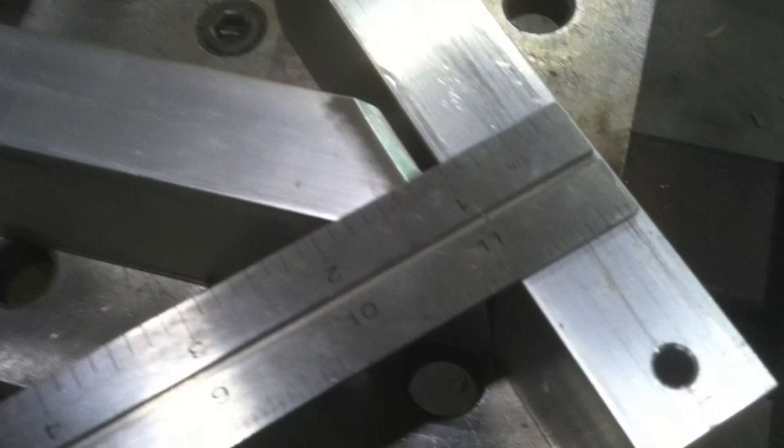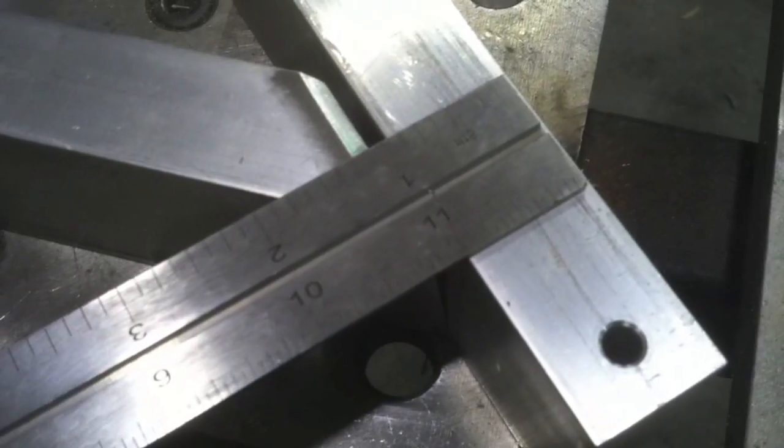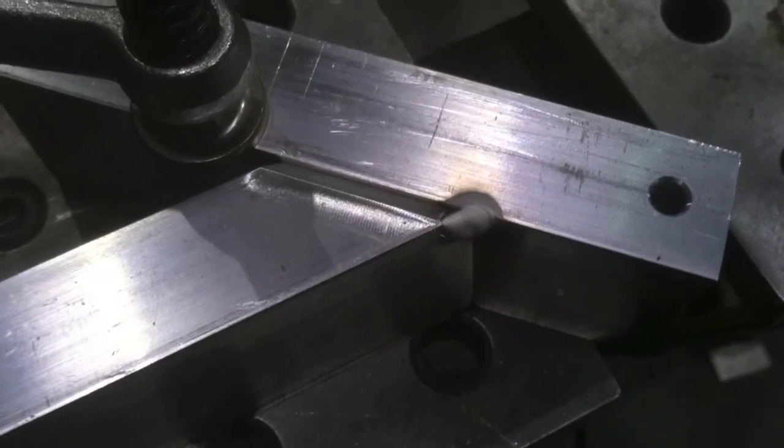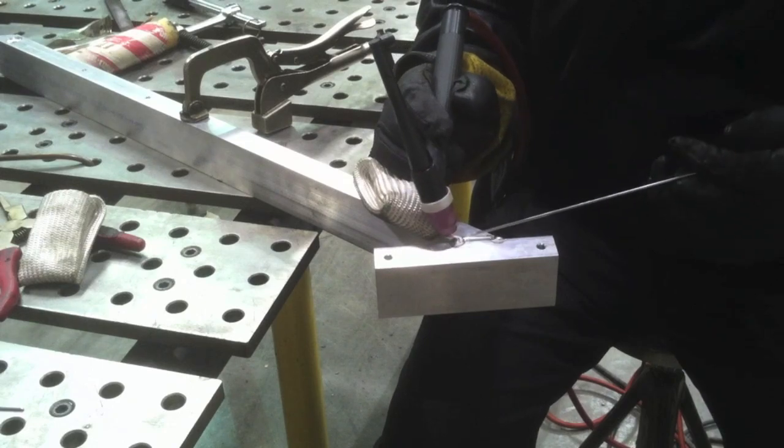You'll actually get more out of an inverter like this by setting the frequency down to 50 Hertz or so, rather than setting it up high to pinpoint the heat. That, along with a preheat and sometimes the addition of helium, will be what's needed to get the most out of a machine like this without a really big power source. You can hear a big difference in the sound — a really low rattle — and that's typical of lower frequencies, but that lower frequency is what's necessary to make that stuff melt.